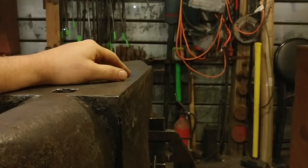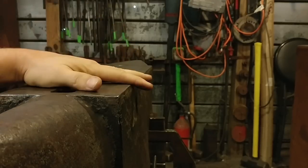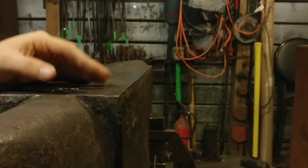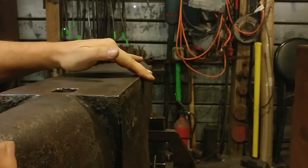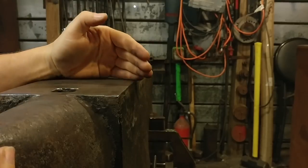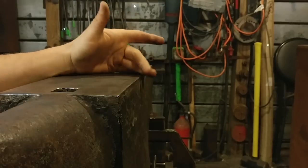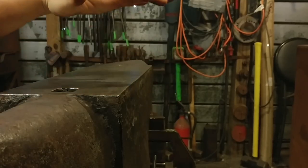Real quick before we get to hammering — I want to take a moment to validate something from a previous video about sharp corners and edges on anvils. It is very hard to do good tong work on really radiused edges. The reason, especially for beginners, is that you need to create your first initial set down and progressive set downs of material and isolate very specific sections. That is very difficult on a crowned surface because the material wants to skate or slide off where you originally made your set down.